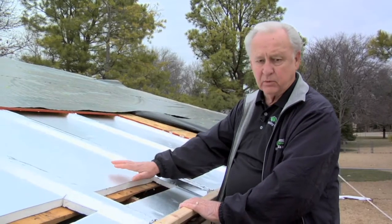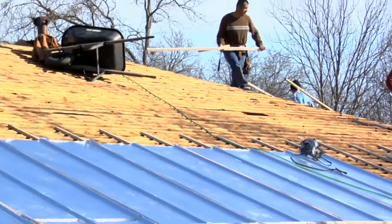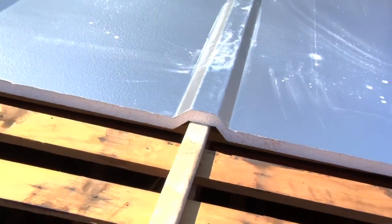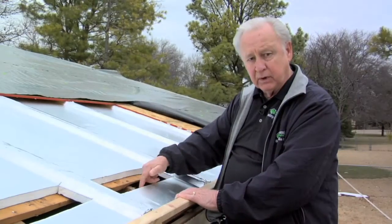The first thing we stop is the radiant heat. The aluminum reflects about 97% of your radiant heat — it's reflected right back where it comes from. The second way we stop the heat from getting into the attic is we've got a one-inch polystyrene which is going to have about an R5 insulation, so it's very difficult for any heat to be conducted through into the attic.